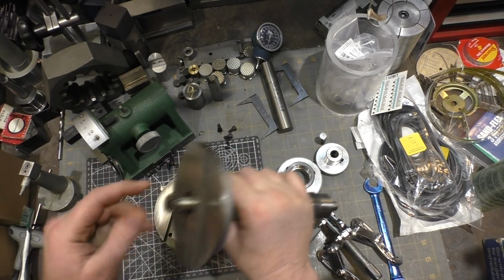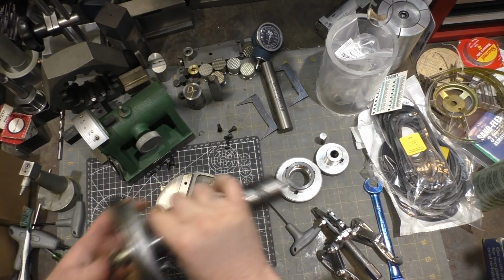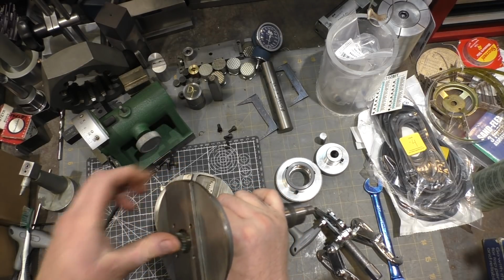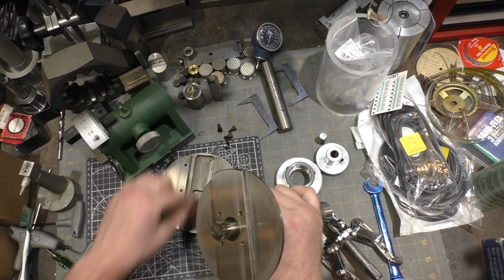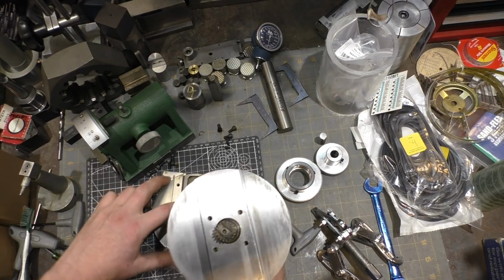So this is the pinion, and it's supposed to engage with the rack, and so you can pull it out on that side and re-engage. If you want to do just a one-sided turn, you can disengage the gear, slide this dovetail way over, re-engage it, and just move on that portion, or you can recenter it, etc.